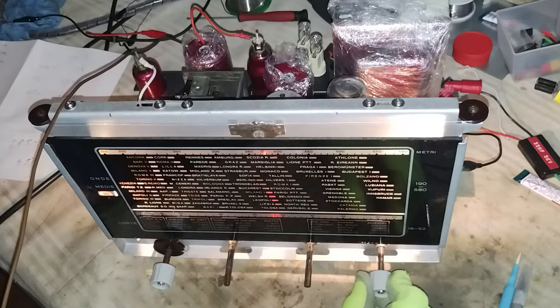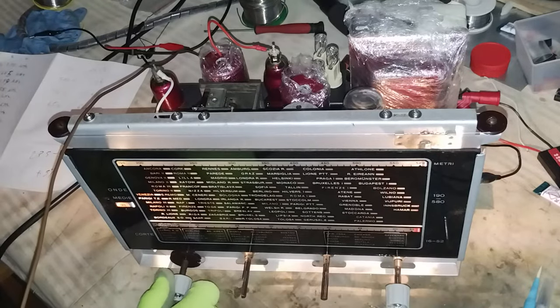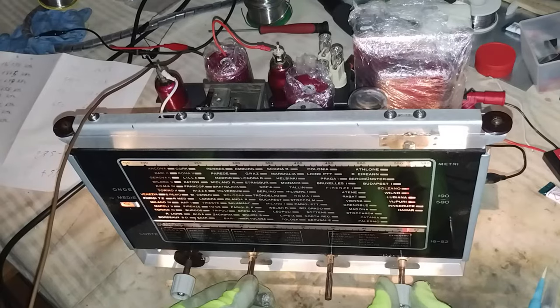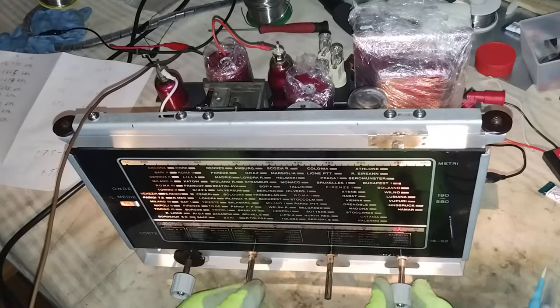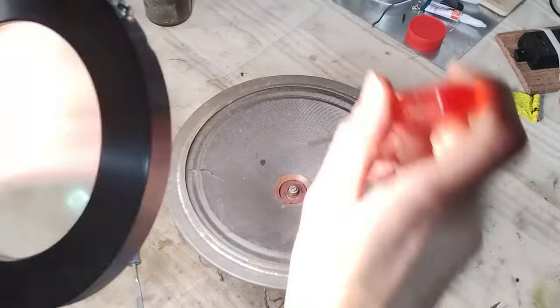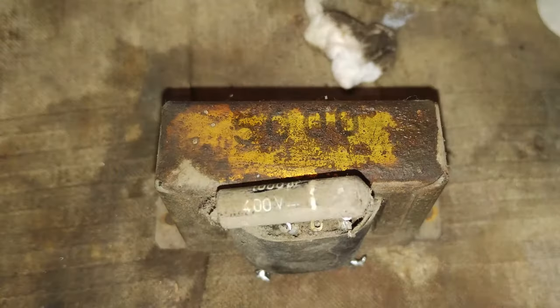From the early tests, the radio appears to have a poor sensitivity that obliges to keep the volume to the maximum level, which unfortunately will be confirmed later when a new output transformer will be installed. After having verified that the radio can return to be operational, a replacement for the output transformer is ordered and the work on the loudspeaker can begin.